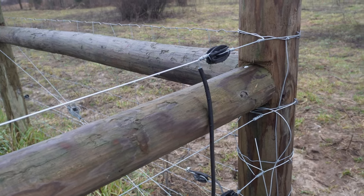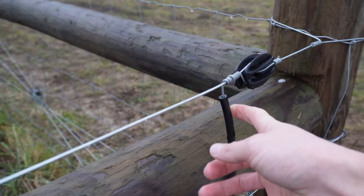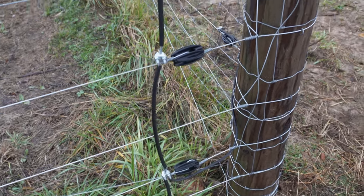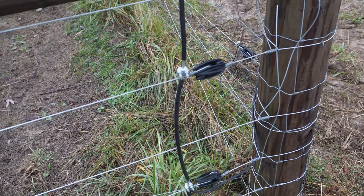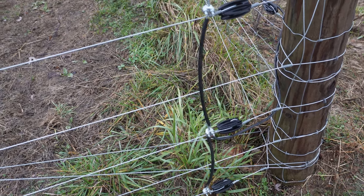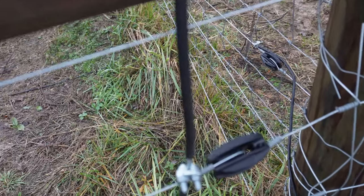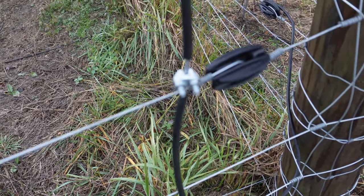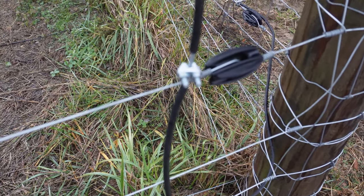If you remember, I said I always leave about 55 inches or so of that top wire hanging loose — and here's where that's important. I use that piece of the top wire to connect the other four hot wires. I pull it down using a section of insulated electric fence tubing to protect it from the ground wires, and connect it to a small piece of wire left on each strand using cable clamps. You can get actual connectors for high tensile wire, but I find that bulk cable clamps are just as cheap or cheaper than actual fence splicers — and they're also galvanized.